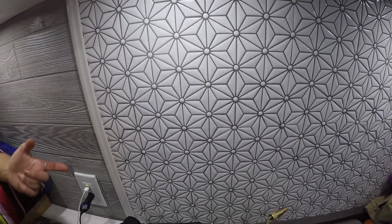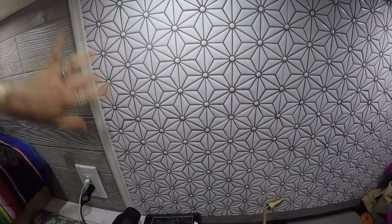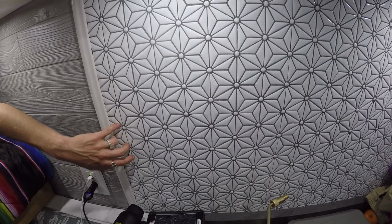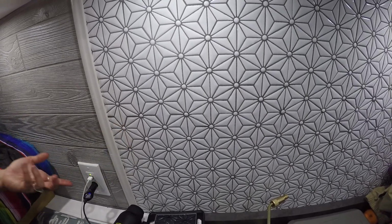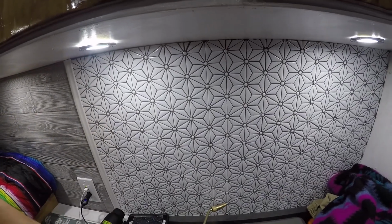That we picked out, and basically what we did is we put an adhesive, and then for the grout, because there's so much flex, like the heat fluctuates a lot in here and you're kind of moving a lot, we used a flex grout, just a concrete color in between to match the concrete tops.